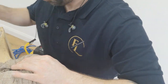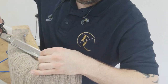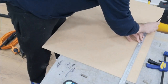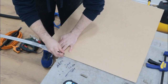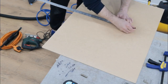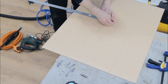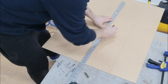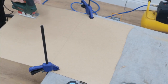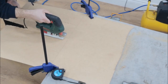As you're starting to see here, the style of the arm is changing — the customer specifically asked for it. Now we're on to the facings, the upholstered faces that go on the front of the arm with piping. What I do is cut four equal panels out of wood, clamp the wood down — it's only very thin wood, I think it's three mil — because you don't want it too thick, you don't want the facing sticking out.